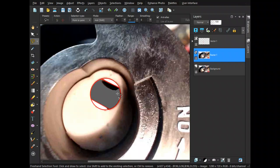So you've got the elastomer coming across the top here and the bottom here, and the gray is the body of that variable charge bar. And that little black slot is all the gap left for the powder to get in, to fill. And my problem was that the first fill would be full capacity. Next fill would be about half capacity. Next fill after that would be maybe 20%. So I'm going from 5 grains to about 2.5 to 3 grains, down to 1.5 grains, down to empty,